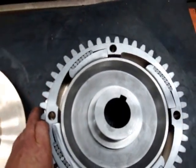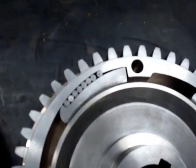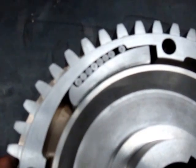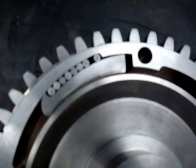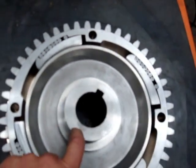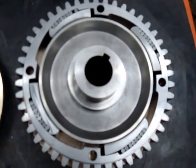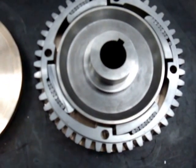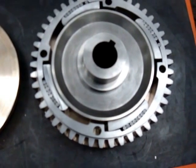As the clutch gear moves clockwise, the rollers and wedges get squeezed into a smaller space and the leather-covered shoe grabs the core of the clutch and turns the inside of the clutch, which is connected to the main shaft. That's the magic of how the Otto Langen converts the reciprocatory motion of the rack gear to rotary motion on the main output shaft.